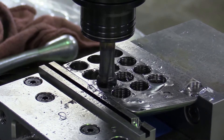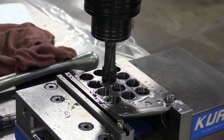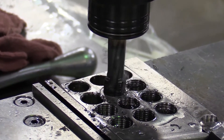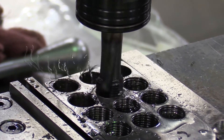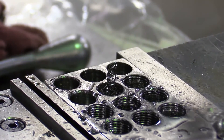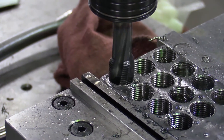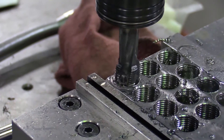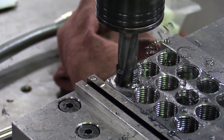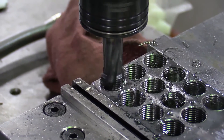You can see some of the holes here — some of them gave us a little bit of trouble when we were using that plug tap, but we did finish a majority of them. We recommend going with a little bit more torque; it's well worth it. Investing in proper tooling — a tap with more of a spiral — would be ideal and would evacuate the chips better.